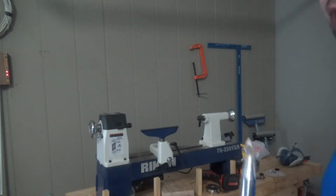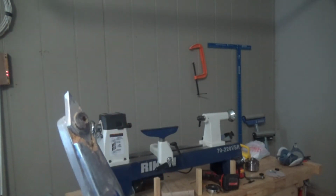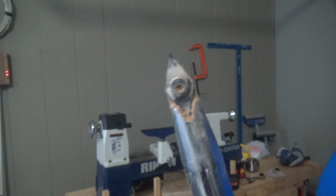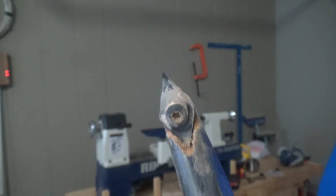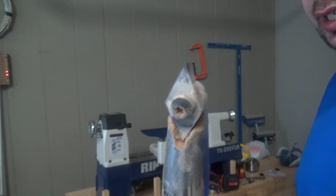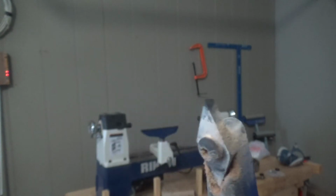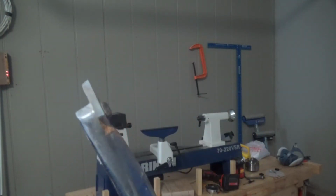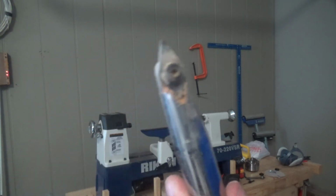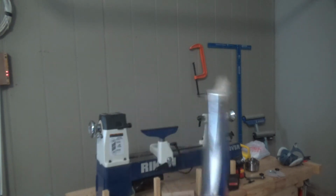And then the last one I have is the diamond cutter. Now the diamond cutter is used for 2 things for me. One is for detail work. Like if I wanted to put grooves on there, I can do that because of its pointy bit there. This can also be used as a parting tool, which is to cut off the finished workpiece from the rest of the blank for when you're done cutting. And unlike the other 2, there's only 2 positions for this cutter. Once one side is used up, you just have to flip it around, and then once the other side's done, then it's time for a new cutter.